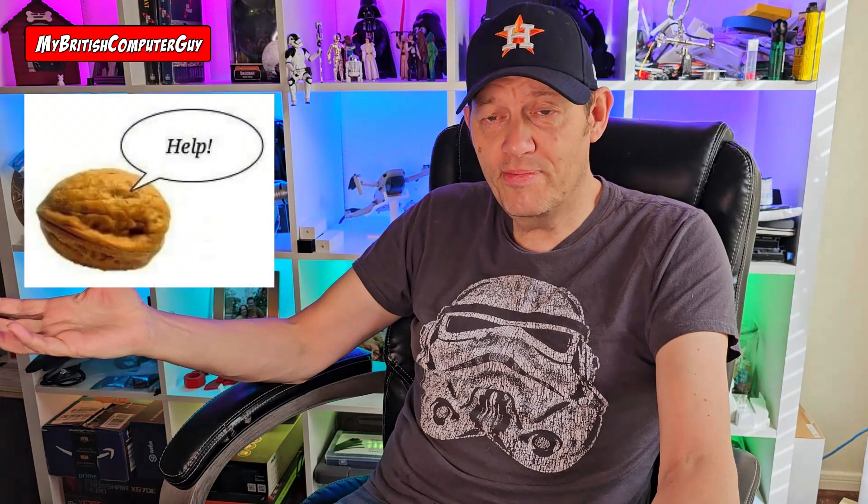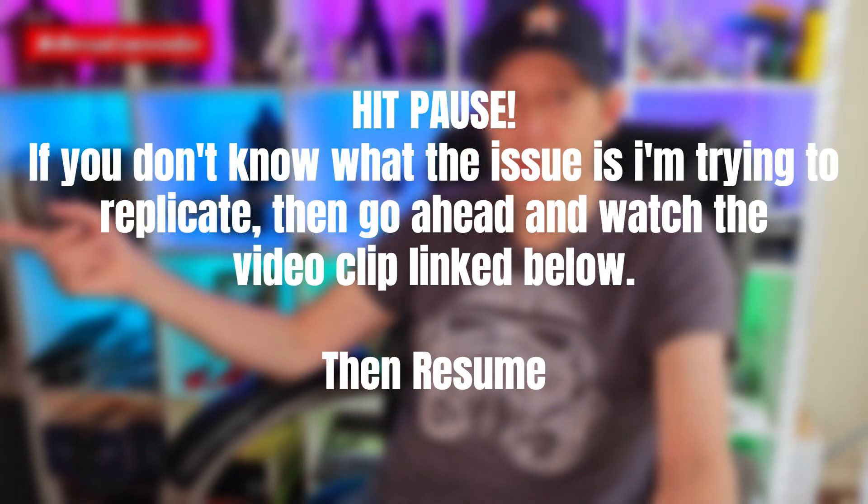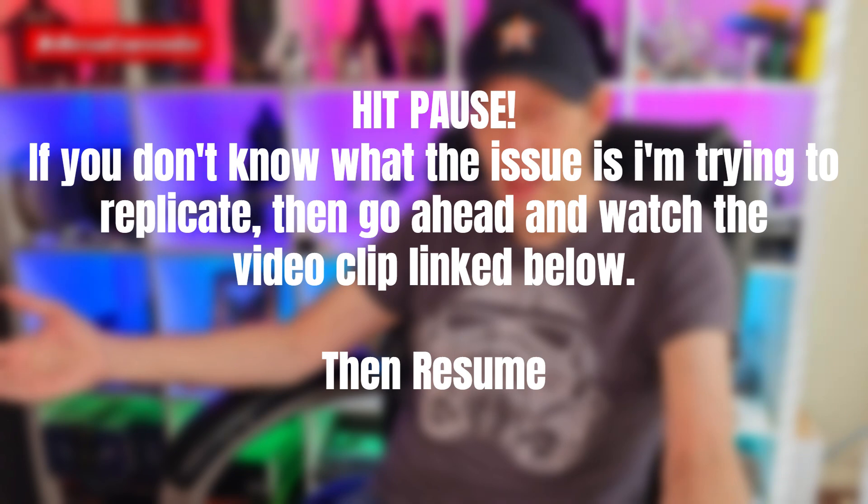It gave me a good understanding of how they work. Basically, in a nutshell, it takes the three volt output from the data pin on your ESP32 chip and ramps it up to five volts — because five volts travels further along cable than three volts, and that should solve your data problem. My video was going to be an experiment to recreate the issue and show you some creative solutions. Things didn't quite go according to plan, as you're about to find out.